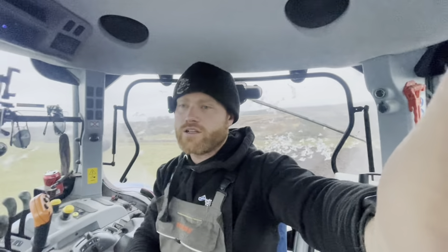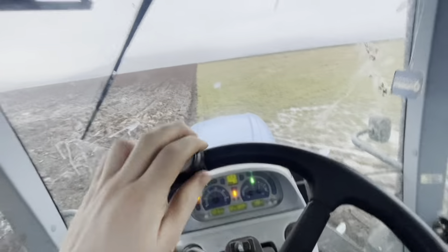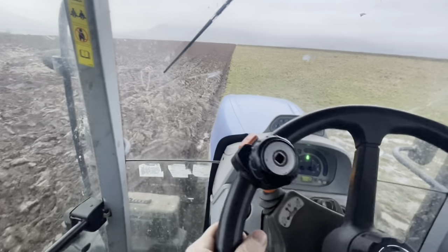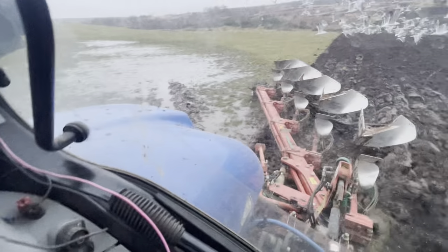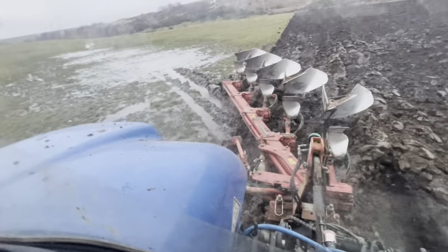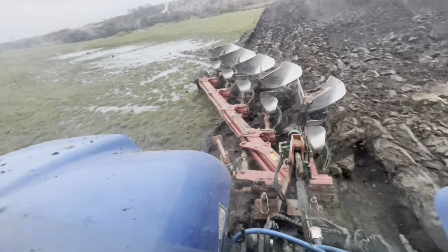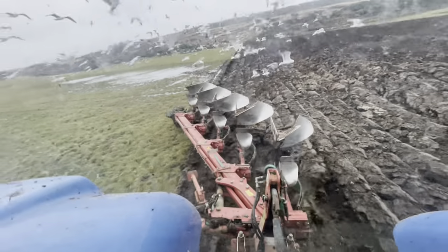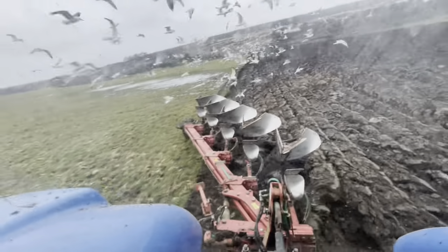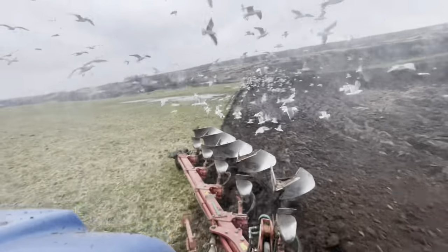When you've got the plough set right like that, it's not much effort to keep it straight. The biggest effort here is just to try and not get stuck — see me spinning away here. But diff lock's on, and I've got the wheel slip option on as well. So if I slip too much you'll see the front lifting a little bit, and that just gives me enough to get through. And as you can see, it's leaving it reasonably level — that run there was pretty good.